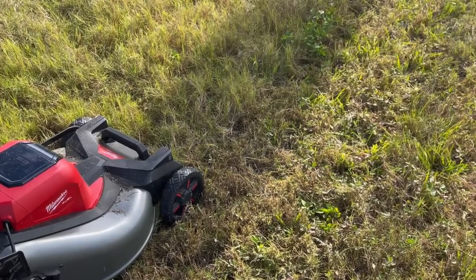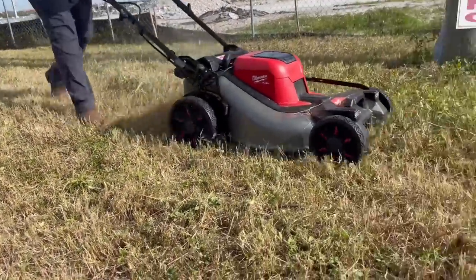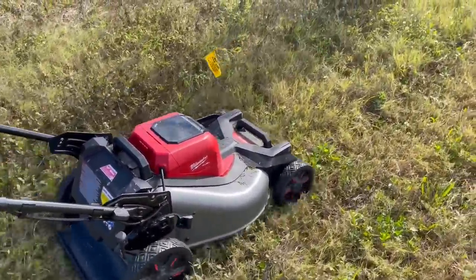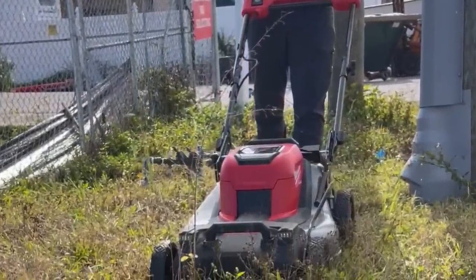For the final portion of the test, we moved to another part of the lot where the grass was more conventional to see how long the battery would last on one remaining LED and how the mower would behave when fully exhausted. It lasted another 15 minutes, cutting well throughout. We continued using the side discharge chute as the lightest load. When the batteries were nearly done, the single LED flashed; we hit a dense patch and the mower simply stopped — lights out, no power. In total, we used the mower for 65 minutes of aggressive cutting with no difficulties.